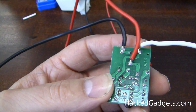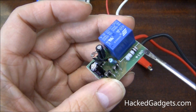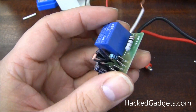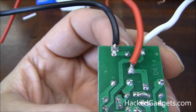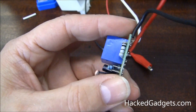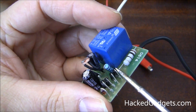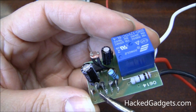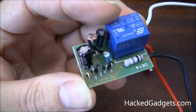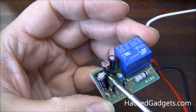I don't really like the way these wires are connected. They could have spent no extra money and moved this over just a little bit, and just tagged the three inputs here. It still would have been a single-sided board, instead of just having these connections tagged onto the back and soldered on — it would have been much nicer. Here's your DC input — it comes through this 10-ohm resistor and basically feeds the rest of the circuit. They probably saved a few pennies here — these four diodes are just a bridge rectifier. It would have been nicer to see an actual single bridge component, but they probably saved a cent and a half.